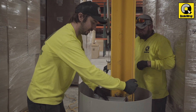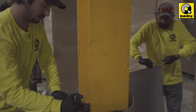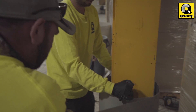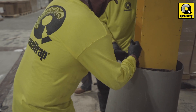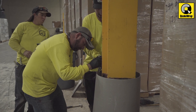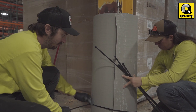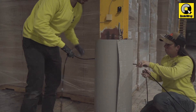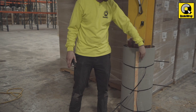You want to do what you can to get a nice and tight radius, then go ahead and start pulling that in and just walk it around nice and tight. Once a basic radius has been set and you've locked in the top corner, you can take some zip ties and get them down to a decent grip. I'd recommend at least three sets per height of jacket to distribute that load. Once you have the zip ties on to set the radius, you're in good shape.